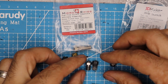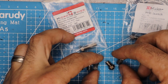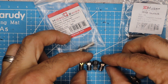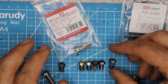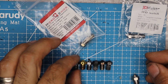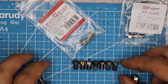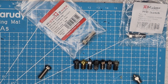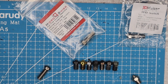Something to keep in mind: just because a nozzle says E3D or MK6 doesn't mean they're all equal. If you look at the actual thread lengths, as I showed in that Thadis video, they can be different — some are actually longer than others. Someone made a good suggestion: sand down the block if it doesn't interface. Some are slightly different lengths, and all that matters is about 0.3–0.4 millimeters short, because the 7mm spec is right on the button for a Dragon hot end. The Mosquito gives you a little more room to play.